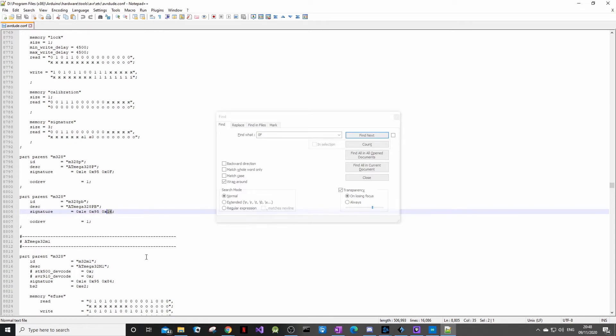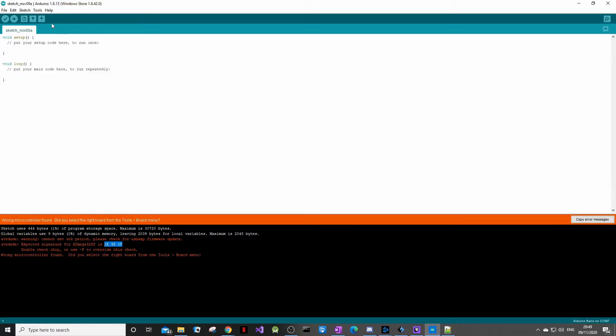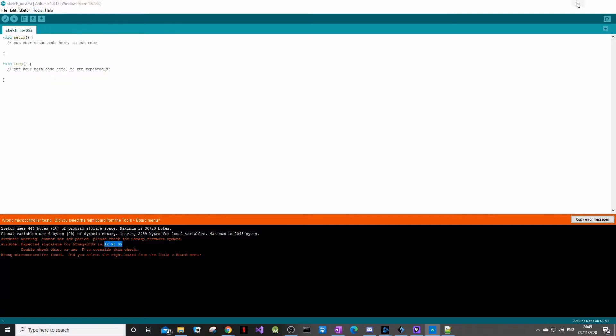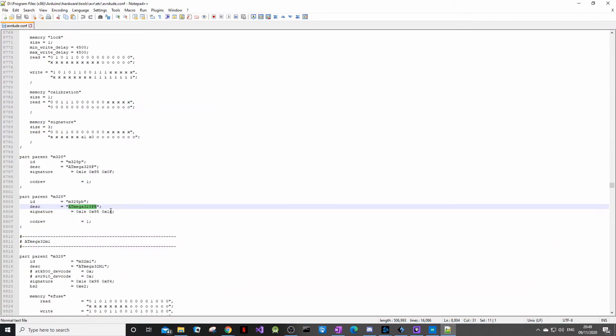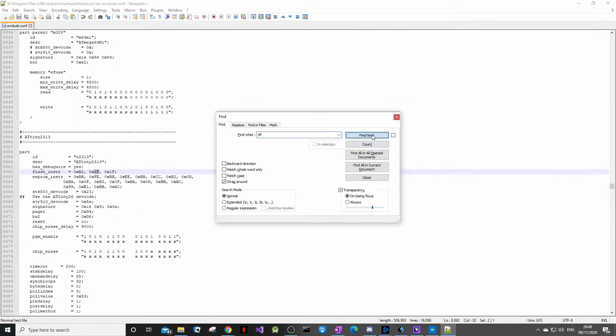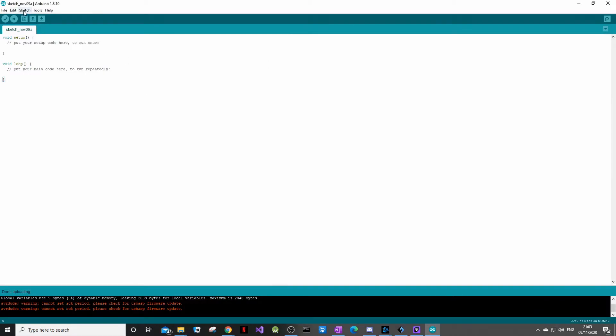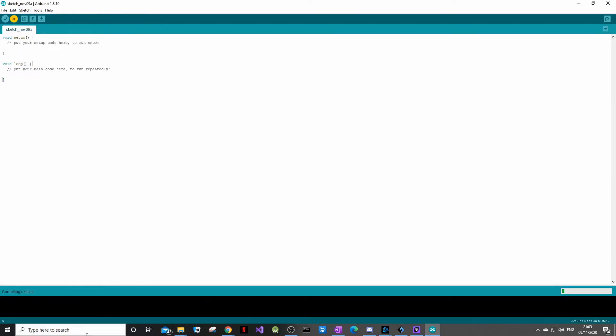In this config file, if I call it PB I'll be able to upload, but I could not find PB listed, so just in case it's nice to learn. What we can do is take this signature and fool it — change it like this — and save. What we did was change the signature of the P from 0F to 16. Save it and close, then open Arduino again, go to Sketch > Upload Using Programmer, and now the error should go away. We're forcing it — look how quick it was. It programmed a blank sketch to my Arduino board.